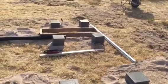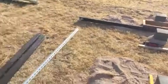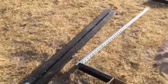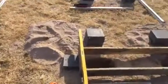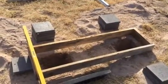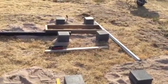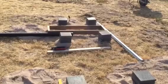So what are we doing now? We'll set these poles up and brace them in place and cut some wire for reinforcement in that bit of a slab, and mix the concrete after breakfast, then concrete. Okay.